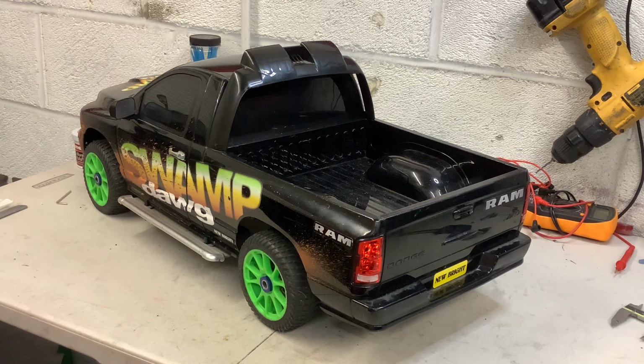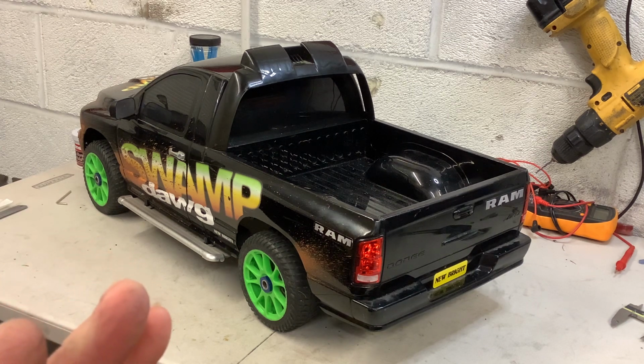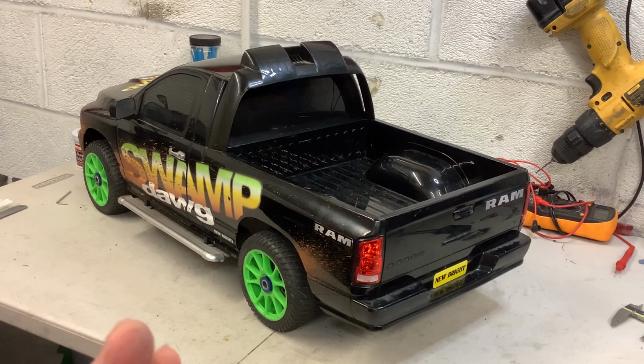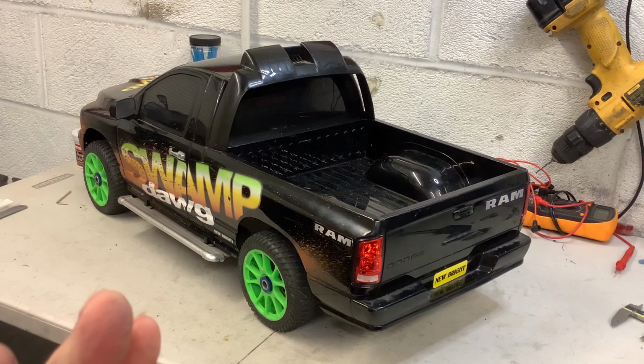I finally built my Toyan 4-cylinder L400 engine at last. It was fairly straightforward. I did have one problem with one of the rocker shafts. It looked like it had been ground up to the end, and there was a radius on it, like the grinding wheel had a radius on it, and I couldn't get the rocker onto the rocker shaft far enough to put the E-clip in it. So I had to put it on my lathe and get the corner out of it so I could push the rocker up far enough to get it on. So that was a problem.